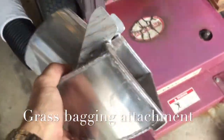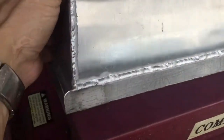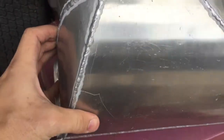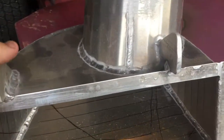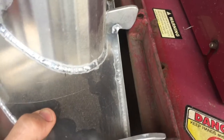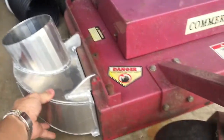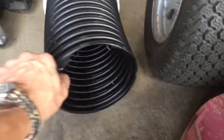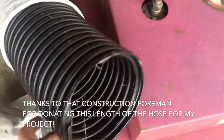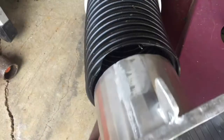The next project is the grass collecting attachment for my lawnmower. I already welded this chute from aluminum sheet metal. Not saying the welds are perfect, but they should hold up — it is welded on both the outside and inside of each seam. It will be attached to the mower using those two thick tabs after I drill a hole in them and put a pin, and it will still be able to swing up if needed. It has a six-inch diameter output port which I will connect a six-inch flexible hose to — kindly donated by a construction worker nearby.